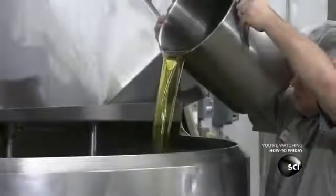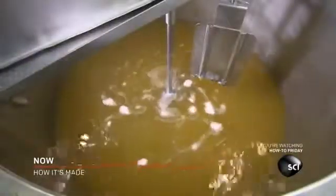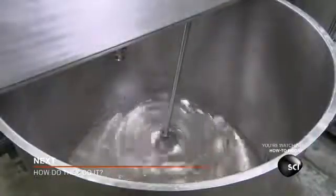Workers heat the stearic acid until it liquefies. Then add the blend of lanolin and isopropyl myristate and keep heating. While the oil phase is heating, they prepare the water-soluble phase of the recipe. The first ingredient is glycerin, derived from a vegetable source such as corn. They heat and mix it, then add purified water.